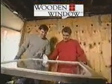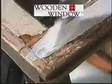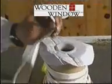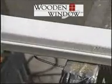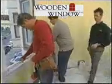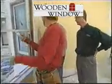Simon, this looks great. This has got to be the original glass. Look at the waves. Yeah. Now for a coat of primer to fill the gaps and protect the windows. After the paint dries, we add a waterproof weather stripping to the top and bottom of each window. It will seal and prevent drafts. Okay, Simon and Bill, we're going to get this last window put in here. It's all put together. We'll start with some paraffin wax on the inside here, so it slides nice and easy.